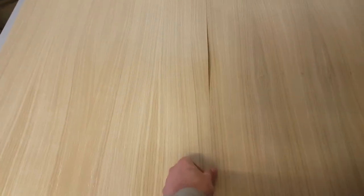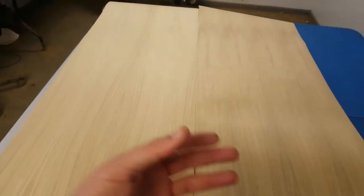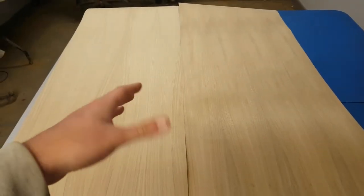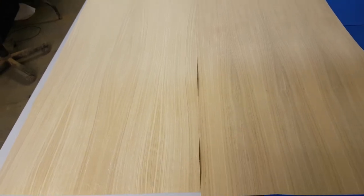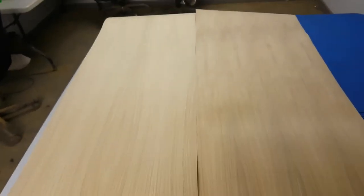Originally I was going to match these together and lay them out side by side, and that's how I figured there'd be enough to do the panels for the v-berth. But now I'm not sure. Possibly once the epoxy and varnish is on you're not going to notice the subtle change in tone. What I'm thinking of doing is cutting the middle and having two of the same for each panel, so by having different tones on different panels it won't be as drastic as having the centre line be lighter on one side and darker on the other on the same panel.